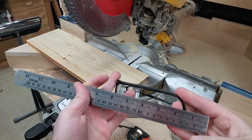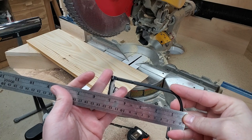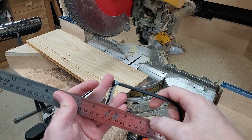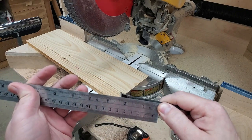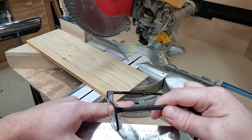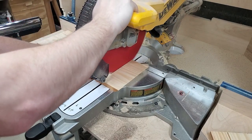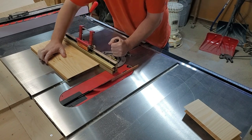Since I didn't do any design work beforehand, I'm literally designing this at the saw. I've got about five inches of earpiece — probably four and three quarters to five and a half is the normal earpiece length. I want the back of the front piece to be about two and a half inches from the wall, and the face will be almost three quarters of an inch thick, putting you about two and a quarter inches worth of glasses sticking out. Then we'll have dowel rods sticking out about three and a half inches. I cut the 45s on the ends, then lopped off the ends to become the pieces that go from the face to the wall, then took that piece back to the table saw and cut 45s in the ends again.